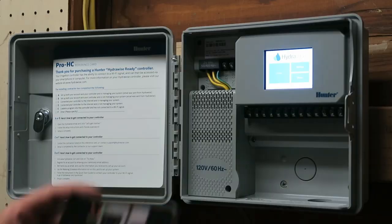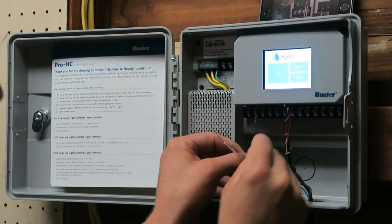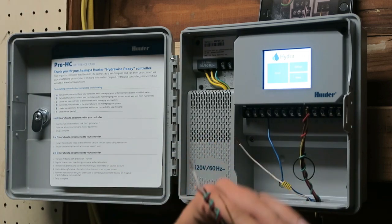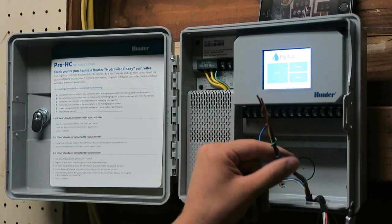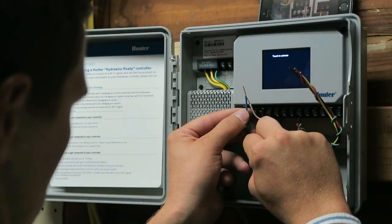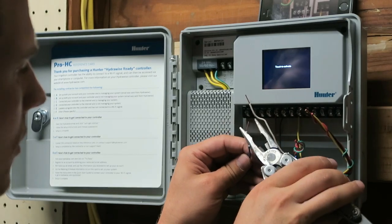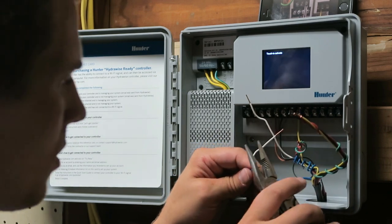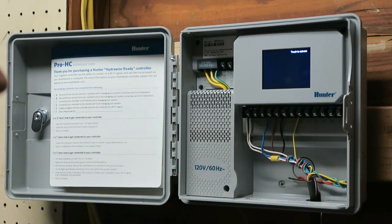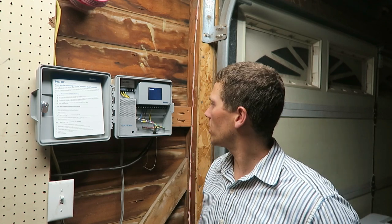I'm going to go ahead and finish connecting these wires. I've got my phone here with my picture for reference. Blue hooks up to station number two — this is a nice firm connection, which means this is a commercial grade controller. I've got two different strands of wire going to different boxes. Brown next, then black, and then yellow for zone 6. That screen blanked out — power saving mode. Really nice clean install, very transparent to see what wires go to what numbers. I'm missing zones one and five — those are zones to be installed in the future. In the front I need to install a lateral line, heads, and a valve, and in the backyard I'm missing a valve.